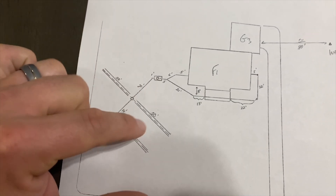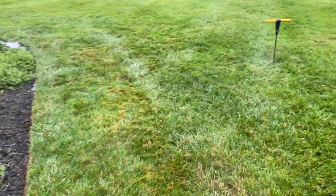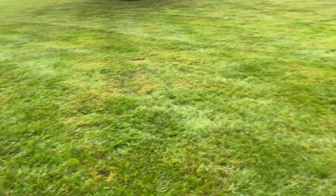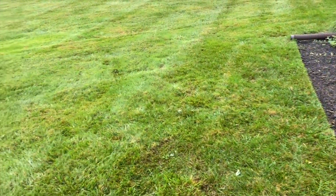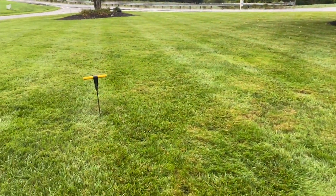Let's go ahead and take a look outside to see if this actually lines up with what's on the property. Standing outside, the grass is in pretty good shape but there's no access that we can see on the surface. The records show there should be a tank somewhere 10 feet off the foundation and three drain fields somewhere over by those trees. Looking at the home, the sewer line exits about halfway in the foundation. We're going to grab the metal detector, look around, and then probe for it.